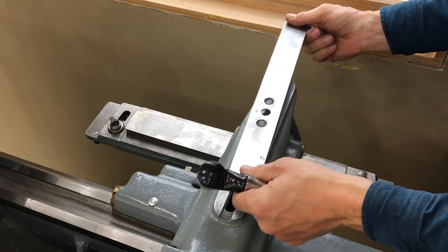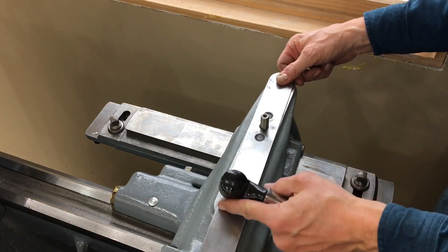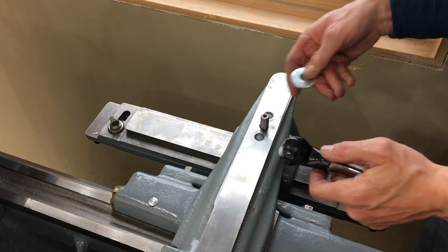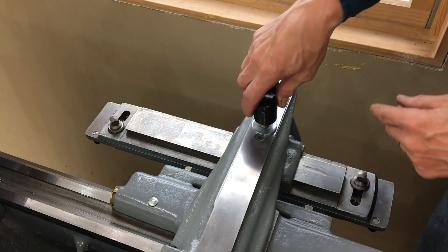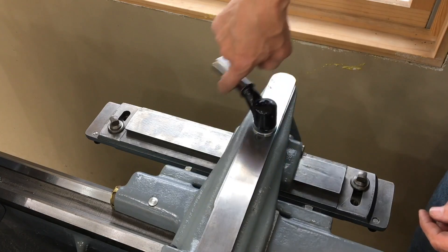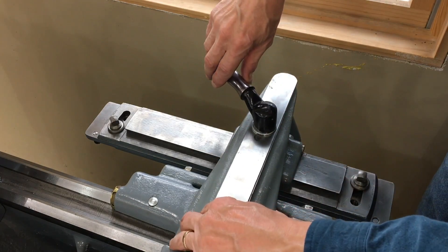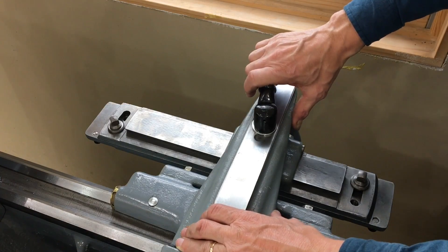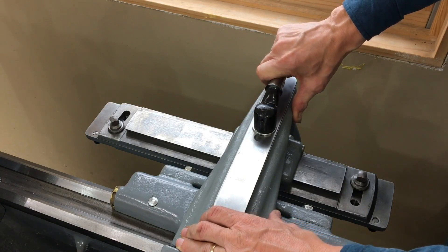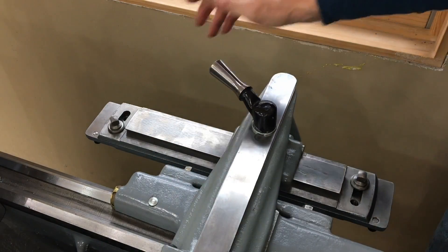This is a thin metal chip guard. I'm told that these are pretty rare actually — they apparently over the course of time get lost or taken off and never get put back on, so I'm happy to have it. This is the binding lever, and when tightened down, it firmly connects the slide block to the cross-feed. We're not going to tighten it down yet.